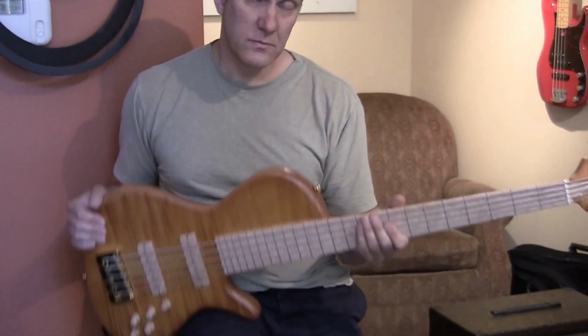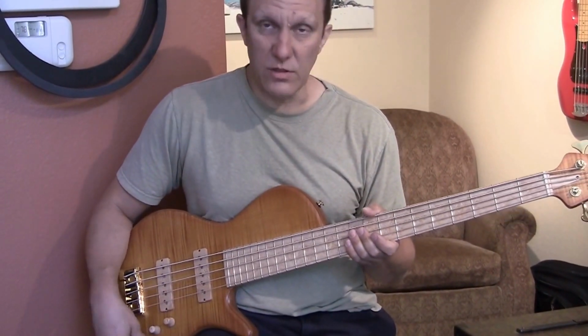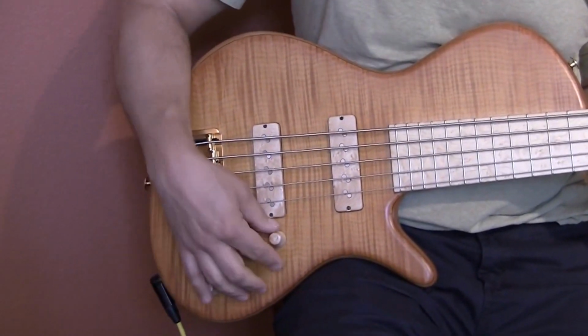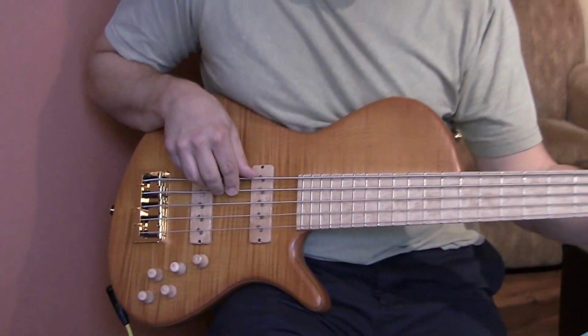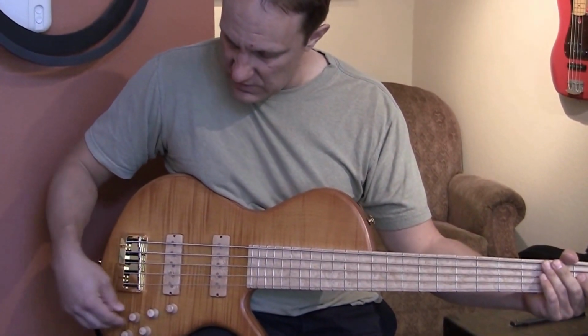And again, that's the SC5, and we replaced our two-band preamp with a three-band preamp. So we've got volume, blend, mid-range, treble, and bass. That's passive. Better check that. And then mid-range frequency on the mid-range knob.